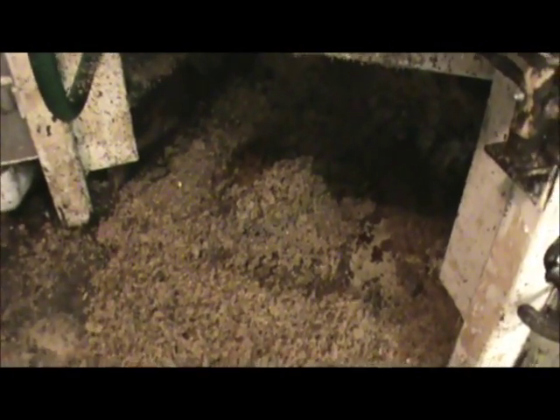It comes out this pipe and goes into this wax and honey separator — it's like a big salad spinner. The honey comes out up here and is pumped over into the holding tank. The wax comes out here, just a little shaving. We take that wax and scoop it into this wax melter — that's just a series of heating water pipes in there. Down in here is where all the melted wax comes to, and there's an auger system that pulls out the slum gum. And what you get is nice clean wax, and the slum gum drops into this bucket over here.